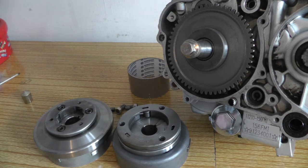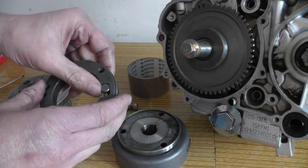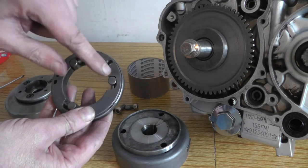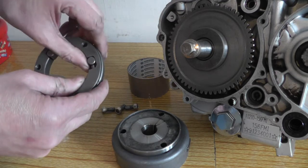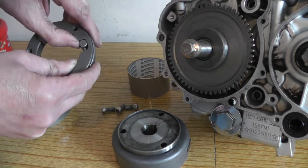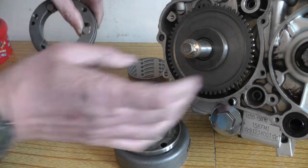Three little bearings. They're similar to a drill clutch in that the housing is shaped — it's bigger on this side than this side. So when the bearing is on the smaller side, it sticks out and turns, and that will grip onto this wheel. When it goes to the bigger side, it will spin freely and not touch that wheel.